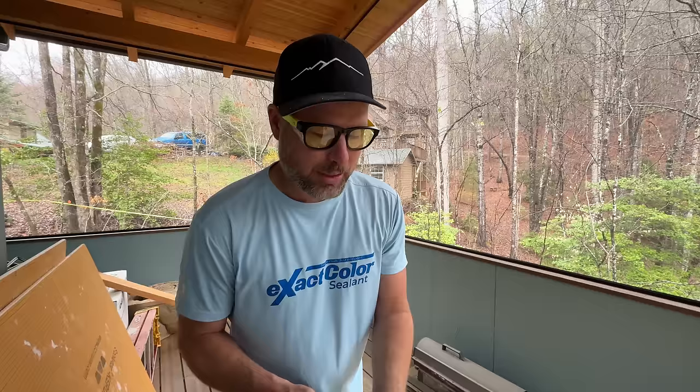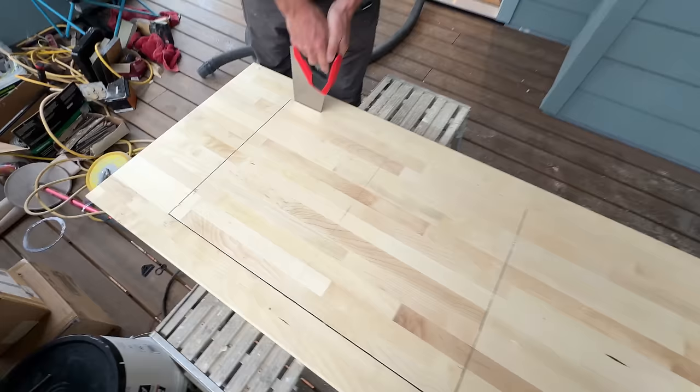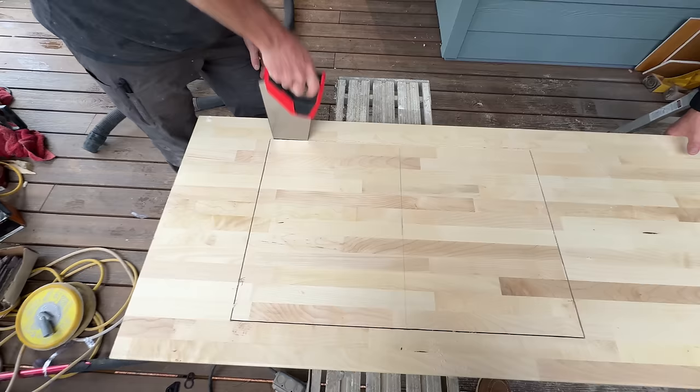I've got this cut out now, but I failed to mention one other critical thing: so that I don't scratch the top because it's wood, I was not putting any weight on the base of the saw - I was holding the weight and just letting it hover just above the work surface. Otherwise you could put blue tape to ride the base on, which lifts it a 64th of an inch - enough to not scratch it.